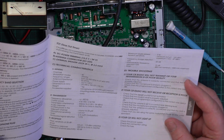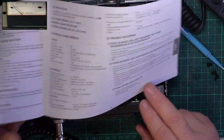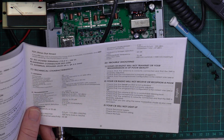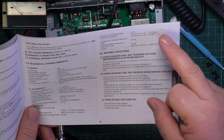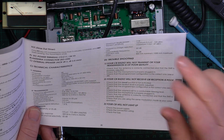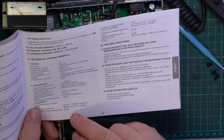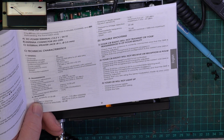So I'm not sure what their idea is. There's different ways of testing. We're in EMF mode, for example, on the signal generator, and you know you can vary these things. I have it on the most difficult to achieve set of settings, so we can fiddle with that, but it doesn't say how they've done it, you see, because we've got PD or EMF, electromotive force, or potential difference. So that's on the output of our signal generator. So if I put it on PD, it's a better signal. EMF is harder to achieve. So they say at 20 dB Synad. So let's put it in the easier PD and look again.